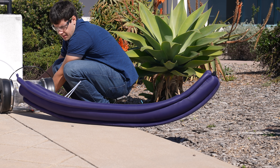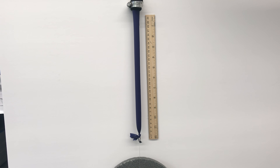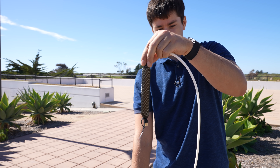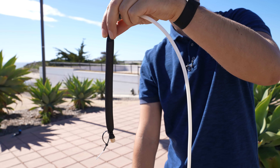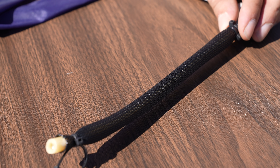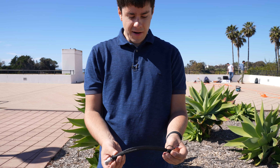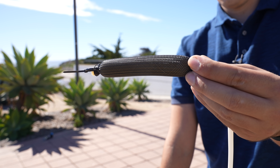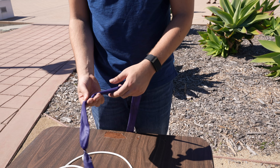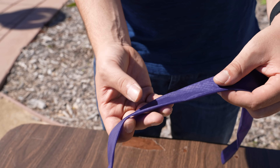What's really interesting is how the vine robot can be actively steered. They attach artificial muscles to the robot. The way this muscle works is that if you inflate it, it expands sideways, which leads to it contracting in length. They don't actually use these much anymore because although it's soft, it's still somewhat stiff.